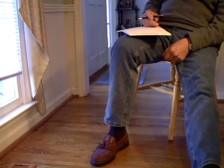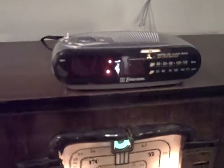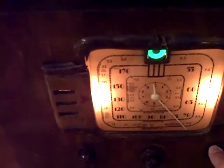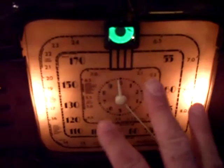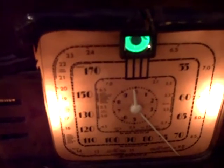That's where the radio is plugged into. I have El Guapo Engineering sitting over here and he's verifying what I'm doing. I put this clock on — it shows an hour and 59 minutes, that's how long the radio has been on, because I started the clock as soon as I turned the radio on. The lights are slightly dimmer and the magic eye is a little dimmer too — we'd expect that because it's about 10 volts less than what was going into it.